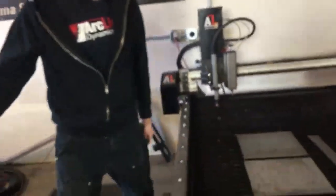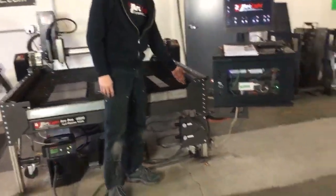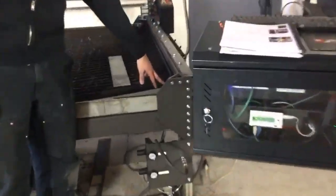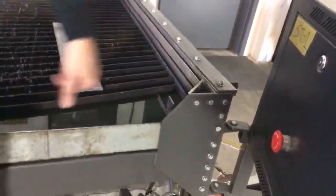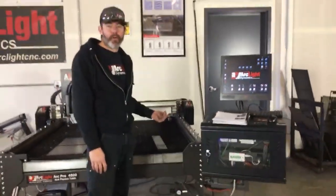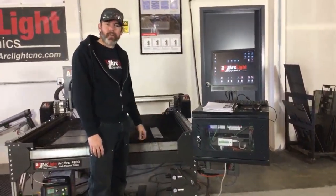Additionally, it's a good idea to clean off your ground tab, particularly if you've got your work lead bolted to your ground tab. You're going to want to unbolt that at the end of the semester and hit that with a wire brush or some Scotch-Brite to remove corrosion, so you're making a good connection between your work lead and your ground tab.